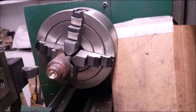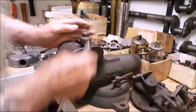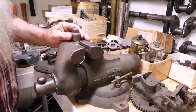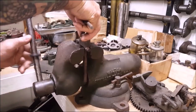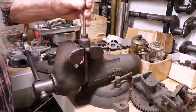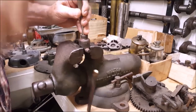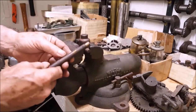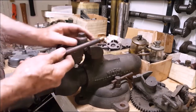Okay, we'll punch that out of there. Here we go. Now we'll make a new one of them — turn that shoulder on there, put it back up in there and peen it over. That's all there is to that.